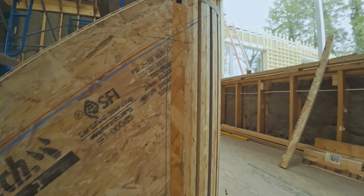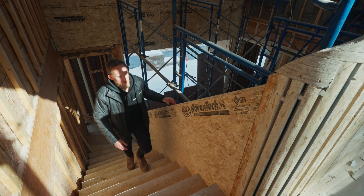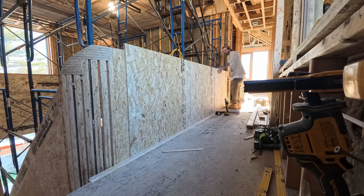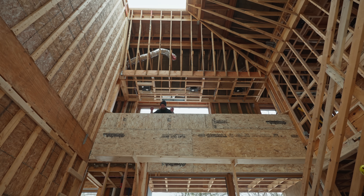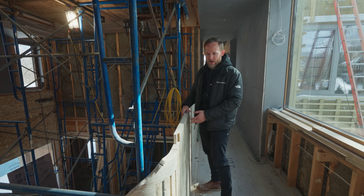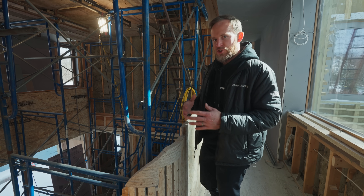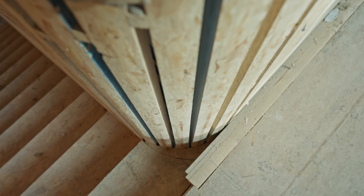I'm excited to be at this point of this entryway. As we get further through construction, you're starting to uncover those really intricate details. First pass, the staircase can look really simple, but the more you look at it, the more complicated it is. As you come up the staircase, this handrail softens by curving over into what essentially is the guardrail. All of it is solid — typically you'd see balusters and a typical handrail, but this home has a more modern approach. Both walls are solid, will be plastered on both sides, and have a beautiful bullnose. Everything you see right now is roughed in place to get the general shape. You can see how the carpenters built this curve and gave plenty of blocking to provide a nice plaster surface on the upper handrail.